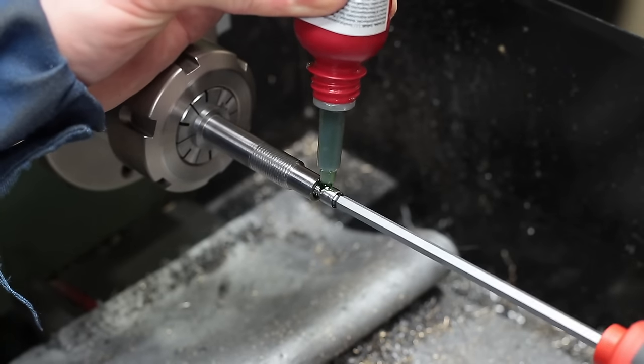And that's the whole anti-backlash nut assembly. I screwed the nut onto a piece of the Acme thread screw for a final finishing cut. To secure the nut on the spindle, I used the small locking nut. As the runout in the collet chuck was horrible, I changed to the four-jaw chuck.